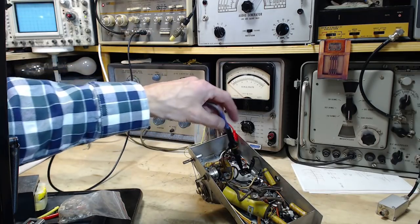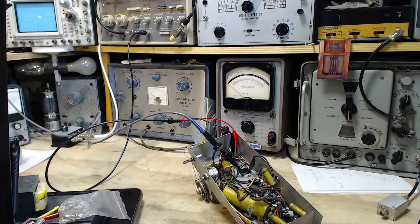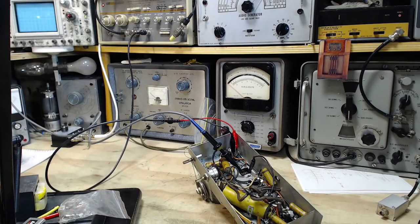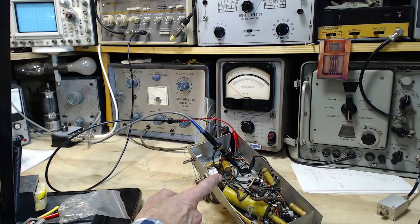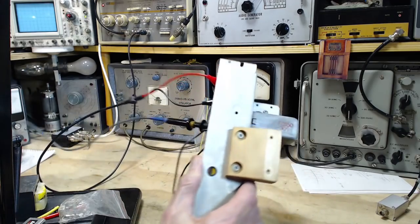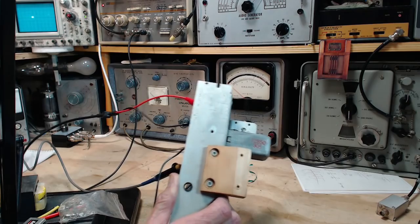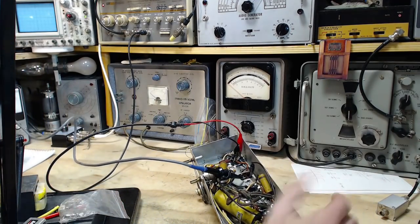So what can we find out from this test? Well, does this thing have any kind of tuned point at all? Is there something wrong in this coil? Is the coil open circuited? There are other ways to do these things too, with an ohmmeter and stuff like that. But when it comes to, can I make this thing tune, or what frequency is this resonant at? That would be another question. You might have an IF. This one's just got some numbers on it. They don't mean anything to me. So what frequency is that IF coil? You could find out by doing this style of testing.